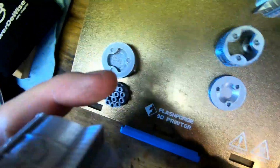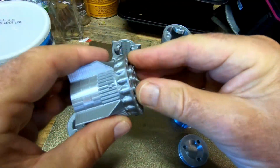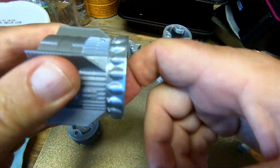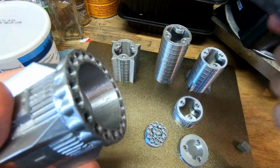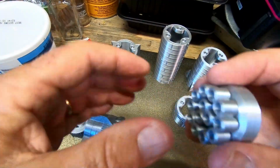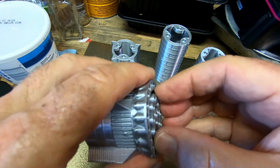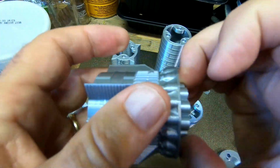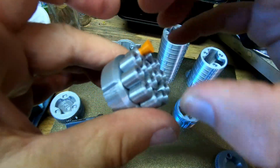And this is, there's the thrust puck, it goes into here with magnets. So it's a nice tight fit. Okay, so there are a few blobs inside of this surface here, so I'll probably sand that down. This is 220 grit sandpaper. I'll get it wet and then sand this out just to make it nice and smooth on the outside, because these have to nest in with each other, and we want it to come in and out easily. So it's going to be held with magnets. So actually, it might be kind of hard to get that out once it's held with a magnet. I guess when the engines are there, there's going to be engines sticking out of this part. Once the engines are on, there'll be something to grab onto, so you can pull it out.